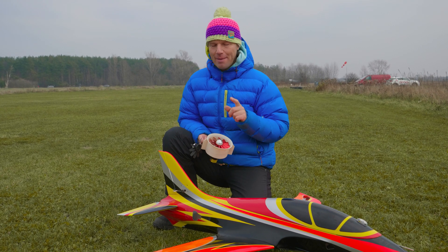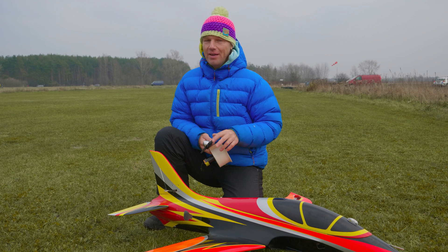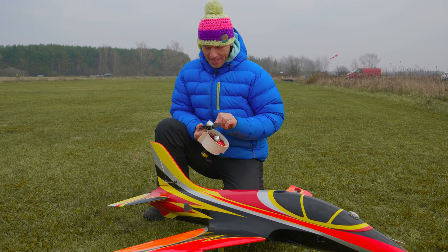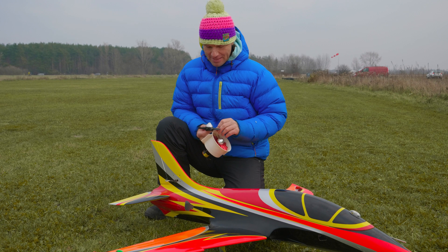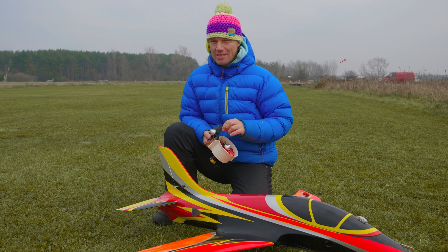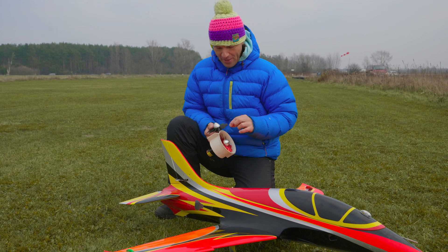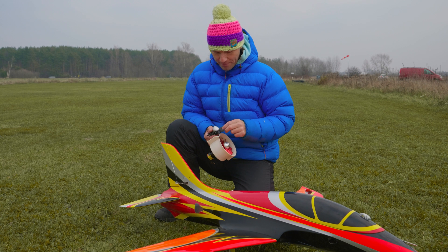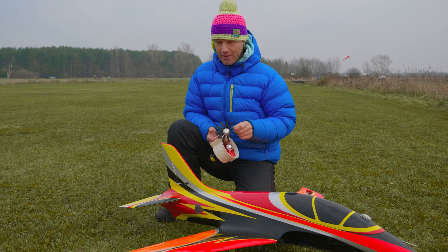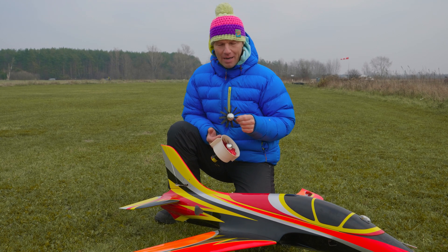That's 10 kilowatts — it's a lot, it's very strong — and I'm very happy to test it. This second one is also 120mm but it's my own design. It's kind of similar to Vemotec because I really like the Vemotec design — it's very smart. I just extended the blades from 100 to 120mm. It's a 3D design done in the computer, and I printed this one on my Prusa 3D printer, which is a very good and inexpensive printer. I printed it in nylon with carbon fiber reinforcement.